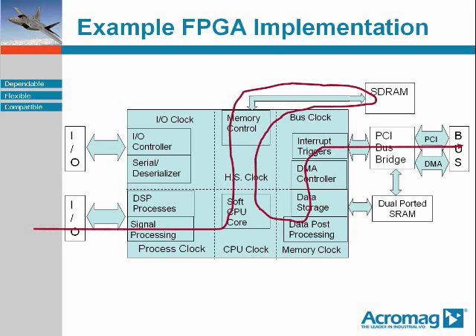A software-defined radio will perhaps sample an analog waveform, extract the carrier with the support of DSP blocks, and perform some algorithmic transformations using the DSP blocks in conjunction with a soft or hard CPU. The resultant information could be consumed locally, or transferred to FIFO storage for additional processing, or for transfer to the host CPU. Host CPU transfer of information would be implemented using DMA methodology, with interrupts configured to signal transfer complete — occurring independent of the FPGA activity and managed completely by the PCIX bus bridge.